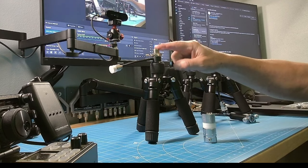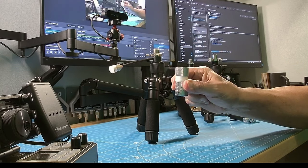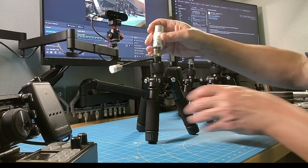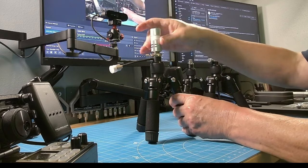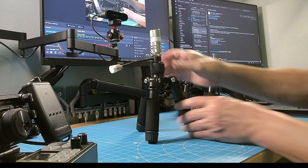How do you get to 3/8x24, which is so commonly used here in the U.S.? You need this adapter — UHF on the bottom and 3/8x24 on the top. And now you have an antenna system that can handle just about anything we can throw at it here in the U.S. for POTA, SOTA, backyard portable.